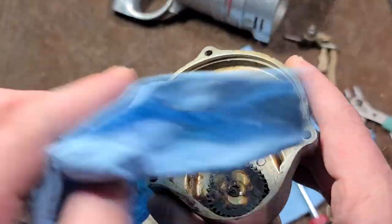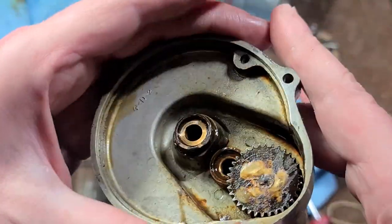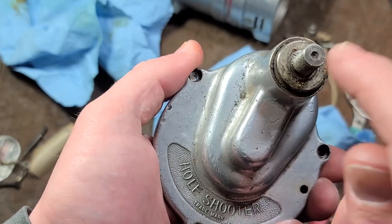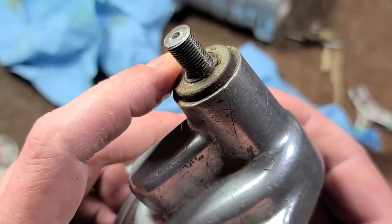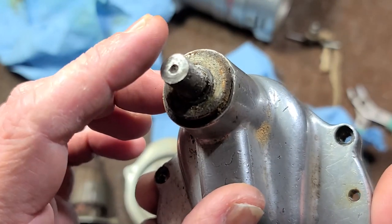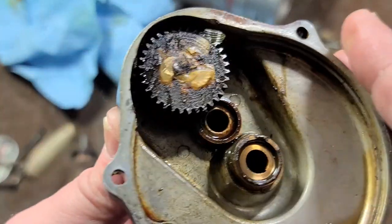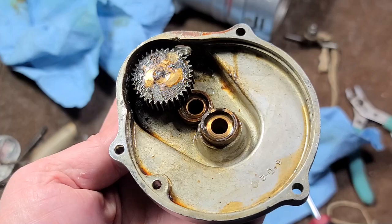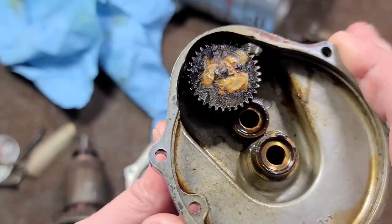So I'm glad I kind of skipped the extra effort of the full video. That appears to have been brazed. I wonder if I can get this spindle off — maybe if this ring here is press-fit onto the spindle, maybe some judicious tapping will get that out. It appears that this is either threaded on there — that's a permanently installed spindle. I think this was machined. I tried hitting it pretty judiciously with a hammer, even put it in the press, and it was just going to crack apart the gearbox before this wanted to come out. And the way they brazed the gear on — I can see why Milwaukee, at some point in the 1940s or so, just made a decision to really change the design of their tools and give them ball bearings and actually make them more serviceable.